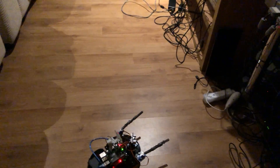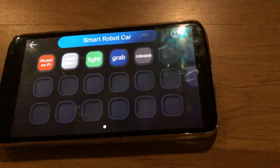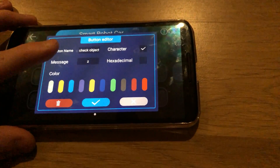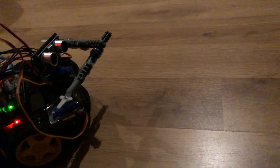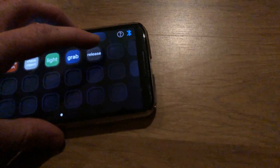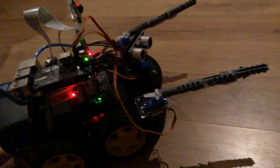The additional part that enables me to talk to the Raspberry Pi is that you can make custom controls. When you click and hold on one, it lets you edit it and set the message sent to the Arduino board via Bluetooth — such as 'grab', which probably needs a bit of work, and 'release'. There's also a shutdown Pi button so you can remotely shut down the Pi and then switch off the power to the Arduino without damaging the SD card on the Pi.